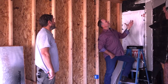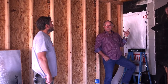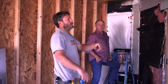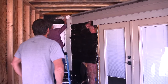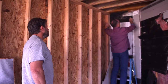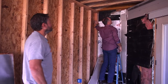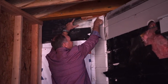I thought they were just trying to carry the roof, but there's one up above it too. The beam that was already in there is probably bearing on some intermediate wall, and it actually has an additional wall right here that sticks out just enough to carry the current beams. On the other side, it was just short of landing on the wall that will be in place in the future, so we've increased the span of this beam.